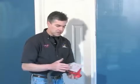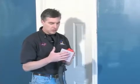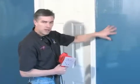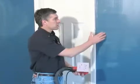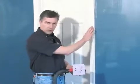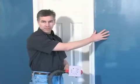And again, as you can see, all the dust was vacuum captured, very little debris on the base of the sander. Another thing we want to emphasize again, use the Norton 3X sandpaper. Just regular sandpaper is going to gum up and get very sticky when you're sanding acrylic paint. And that's one of the great features of the Norton. It cuts a lot better, and it also does not get gummy and sticky when you're sanding either latex on your trim or acrylic or latex on your walls.